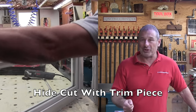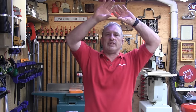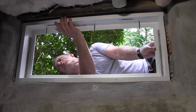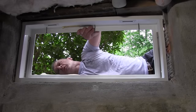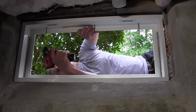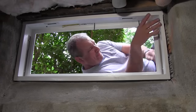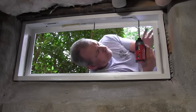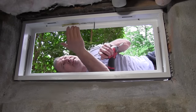When actually installing the window, remove the sash and the screen from the new window so you can access the screw holes. Center your window into the opening. What I do is hold it up tight to the wood house mud sill — the foundation sill — pre-drill some holes, and secure that window up into that mud sill with galvanized or stainless steel screws. If attaching to masonry, use a hammer drill and secure the window in place by installing double-threaded concrete screws along the sides or top of the window, whichever is applicable. Once the window is centered, you should have a slight gap on the sides and bottom if you measured right. You might want to keep it flush with the foundation or set it in a little bit.